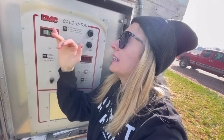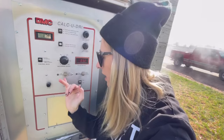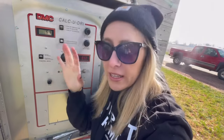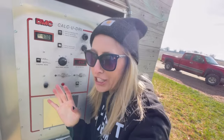If the corn moisture was higher it's going to slow it down; if it was lower it's going to speed it up. That's what this low speed and high speed is about — it's blinking every now and then because it will adjust the speed according to the moisture, so it all kind of relates. We have it on auto for the speed, but you can also run it manually for the control mode. Just a little fun fact — I won't get into too much detail though.